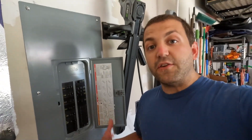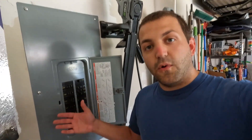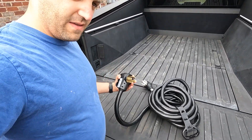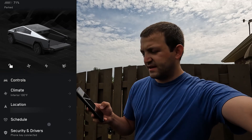We're going to turn the truck power on and make sure it doesn't short out before we tie it into the house. In order to make this work, there's a plug you have to make — there's a reason its nickname is the Widowmaker. It has a male outlet on one side and a male outlet on the other. You have to be extremely careful that when using a plug like this, you have the power off at the panel and off at the truck at all times, or you risk electrocuting yourself or damaging your house or truck.